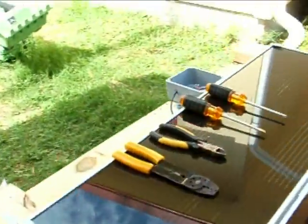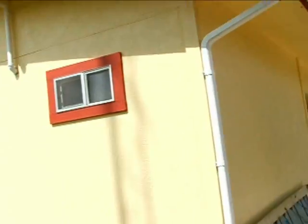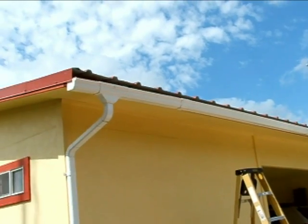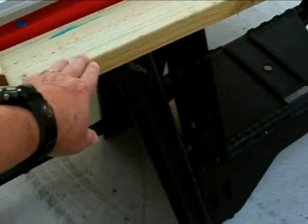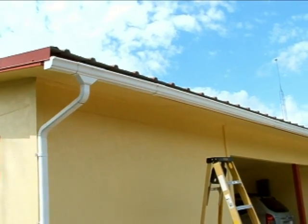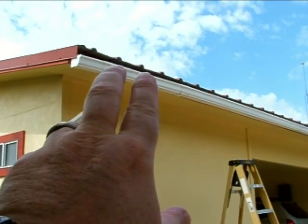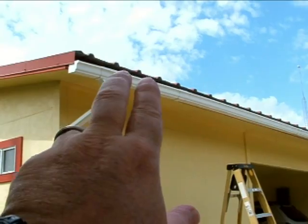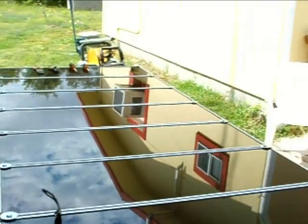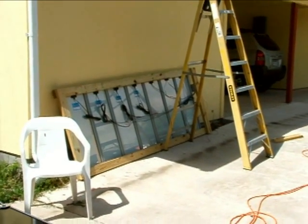Now it's all a matter of closing up the lid on that junction box, throwing them up on the roof, and we're going to be good to go. As you can see, it's a metal roof all around the house. These pieces are going to lay in between the valleys of that — they're about almost a foot across between the ridges — so I'm going to cut pieces that are 10 inches wide to give support in the middle. That's it for now. Thanks for watching and I will post more as soon as we get them up on the roof. Take care.